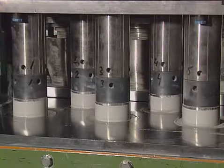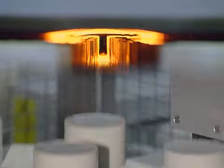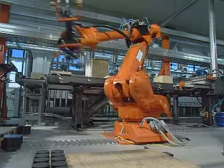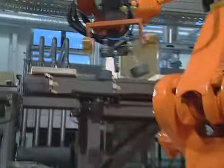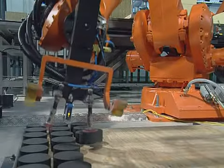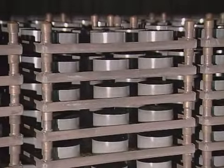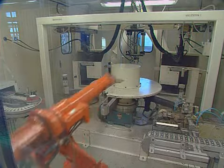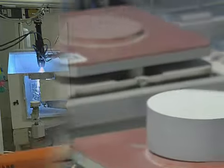The powder that is produced is pressed into blocks under high pressure. A sintering process follows. During this process, the block gets smaller and changes color. An insulating coating is applied to the outer surface. The blocks are heat-treated, after which a thin layer of aluminum is applied to the electrode surfaces in order to obtain good electrical contact between the blocks.